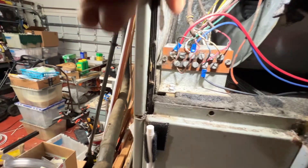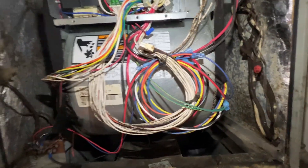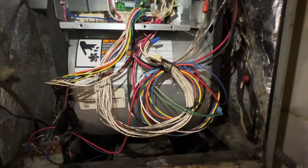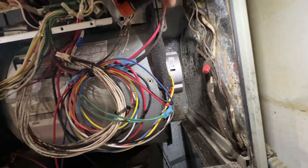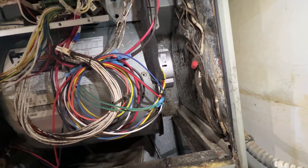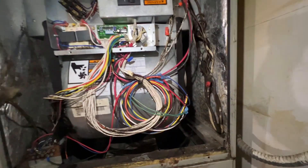That's that. So high speed, low speed, one through five — we'll give them high speed to start out with. All right, so let's recap. That red wire is the fan signal, so I wired that to the fan. And then the black wire is high speed — I wired that to the Y1 signal. Everything else we just looped up here and zip-tied off. Got the terminal there, don't plug — just let it hang. So verify we got power, we got our high-speed signal, we got our fan signal. So let's give that a shot and see how it goes.